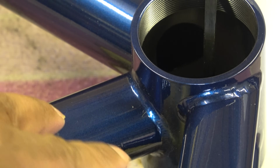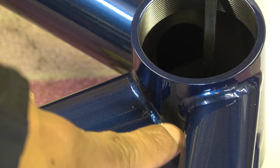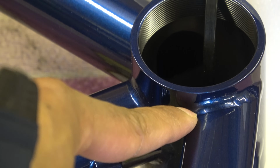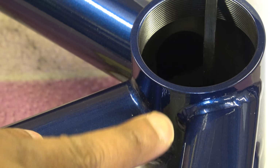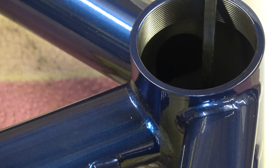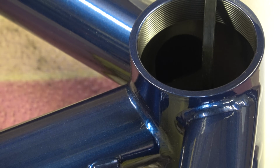Now, one of my colleagues said out of all the welds on here, and he was really scraping the barrel, he thought this one might have a slight lack of pen. Compared to some of the things we've seen on here, we're really scraping the barrel, and it's only partial. It's just because of the nick on there. But on the whole, no real issues with that. The other welds passed the visual okay.